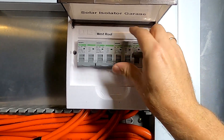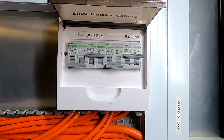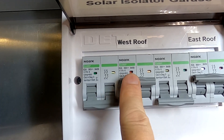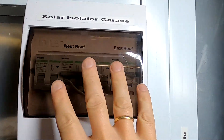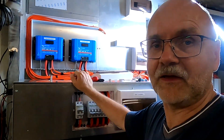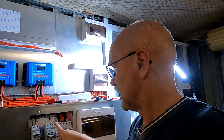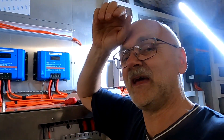We'll leave these two on for tomorrow morning — they're not connected yet. The cables are in, everything is organized, and I've also replaced the 40 amp with a 63 amp for the west roof. This is all finalized. Tomorrow we are going to connect these four cables for the new solar charge controllers — tomorrow will be a big day.